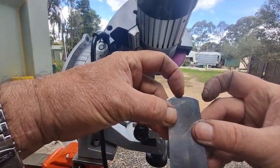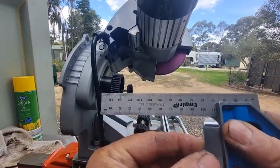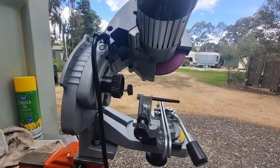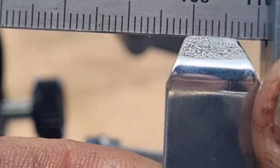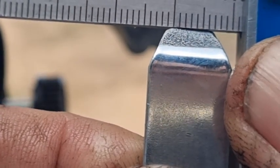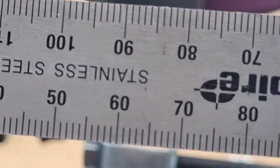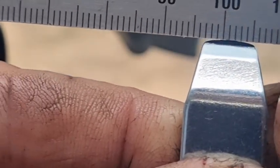On a brand new chain you can leave it in the middle, but you must make sure of that. What I do — it's very simple — is grind off the radius and make it dead flat. There it is, dead flat, simple as that. Whereas a brand new one has a slight radius on it.